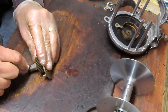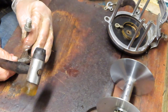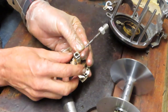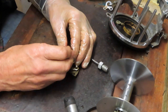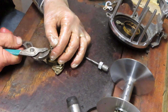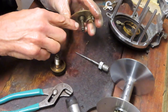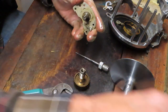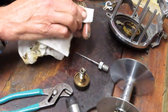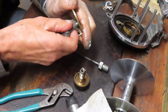There's a pin that holds the gear sleeve on - I'm trying to poke that out. If you can't poke it out, use a soft-blow hammer. I'm using a small punch here. It doesn't take much - just every now and then it doesn't want to come out by itself. Sometimes you may need to grab that little ledge to pull it the rest of the way out if your punch doesn't reach all the way through. That's the pin that retains the gear sleeve to the bridge. Make sure you get it out - there's some dirt and grease and grime in there. Put that in the bucket before it rolls off somewhere.